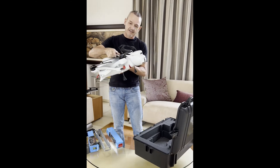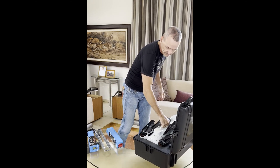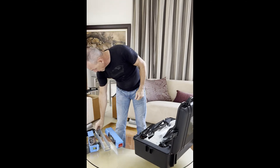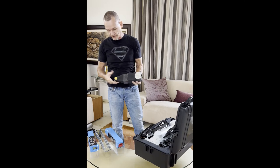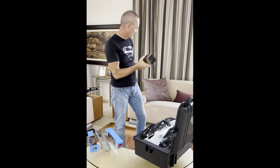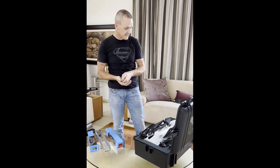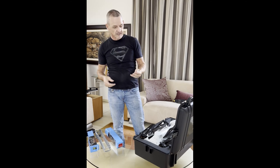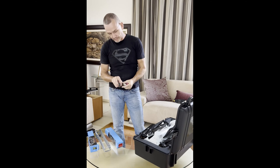It all comes down to the battery — that is why it is the size it is. Multiple batteries are available. The original ones were 6S, and I powered them with a 16,000 LiPo battery like this — it simply slides in and plugs in on its own. That was for the SN8. Then, because I don't like the XT90 or XT-type plugs — it's not a durable plug, it's not made to plug in and out repeatedly with a reliable connection — I switched to proper blade connectors like this.